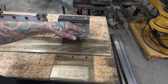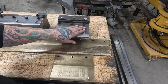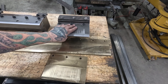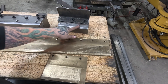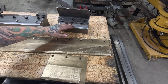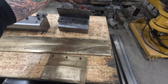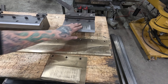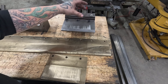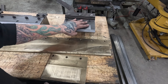So what I did is I ordered some cold finish steel flat bar and machined everything down. I put the same angle at the end where it goes into the female section of the rectangle die, put our holes in it, and essentially this is just an inch shorter than our aluminum bronze wear plate. I did have to modify the holder a little bit — I had to machine an inch out where it comes in and overlaps the die. That was the only thing I had to modify on our die holder or clamp die assembly, and then the same thing on the pressure die: I just made the wear plate an inch shorter and adjusted the machine over.